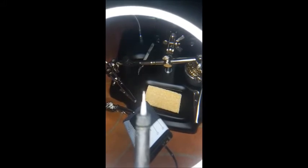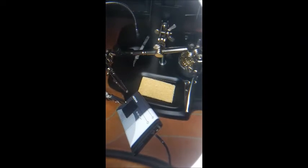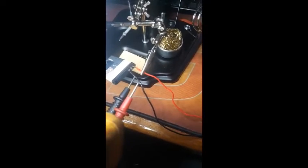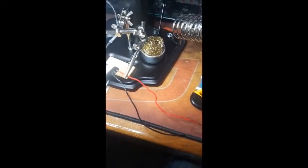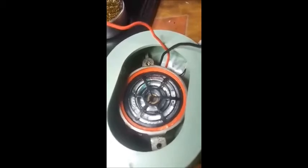I've changed my soldering iron tip now so I should get much cleaner joins than what's in there. I might redo the previous ones. Now with that new tip, measuring with my multimeter - she measures up at 3.8 volts, just like she's supposed to. Battery is almost done.